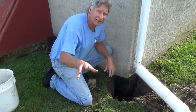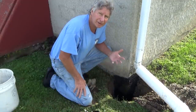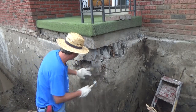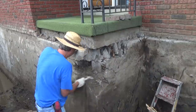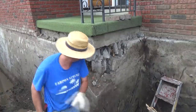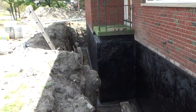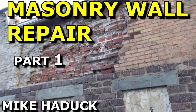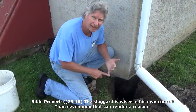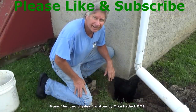I did another little video where the camera went dead on me so I didn't get it all, but you'll get the idea — it's the same thing. Use the cement product, put it together, tar it up, and you're done. This is another one I did — a little bigger, but the camera went dead before I could finish. All you do is dig it all out, wash it out, use your product whether it's stone or brick, put the cement on it, and you're done. That's what it looks like when it's plastered up and tarred. If you want to get into deeper repairs, check out my masonry wall repair and foundation repair playlists. Thanks for watching — I'm Mike Haddock, I'll see you next video.